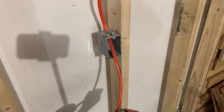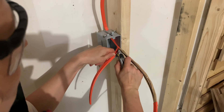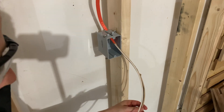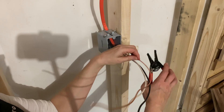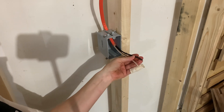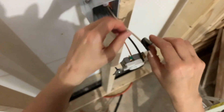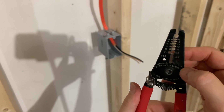Using a utility knife, I'll score the protective plastic sheathing from the wire. When you're doing this, if you run the utility knife down the middle, you won't hit anything important. Cut the protective sheathing and remove the paper covering from the ground wire inside. I generally will cut the wire shorter, leaving at least a foot of wire sticking out of the box. Local electric codes will dictate how much you need to leave outside the box. Because we're going to have two hot wires, I'll wrap the white wire in black electrical tape, indicating that this is now a hot wire. These are the wire cutters I have — they have a little section where you can insert the wire based on its size and it'll strip it appropriately.